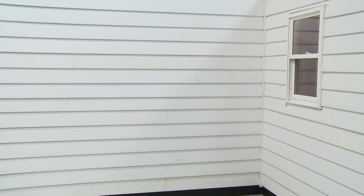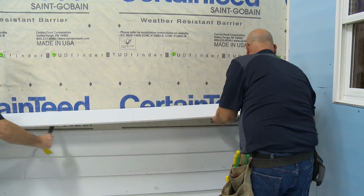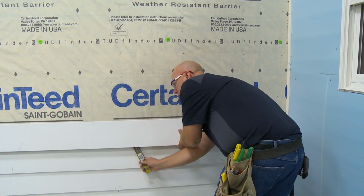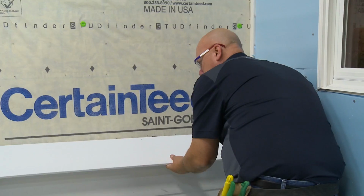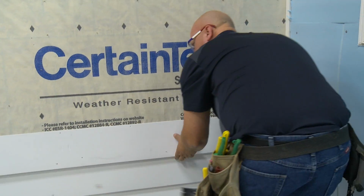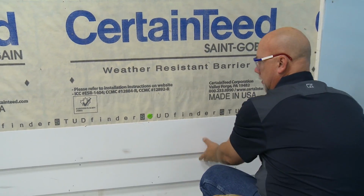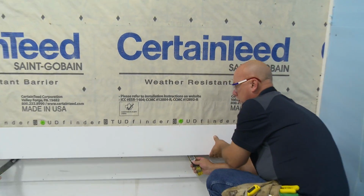You can prepare your current siding surface to receive vinyl siding in one of 3 ways. Option 1. Strip off old siding and level the wall if necessary. If felt paper covers the wall, strip it off completely. If there is no solid sheathing under the old siding, you must apply it first.